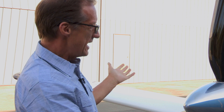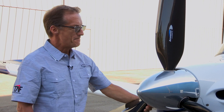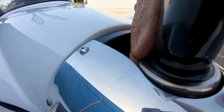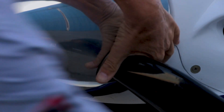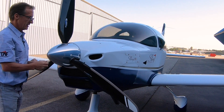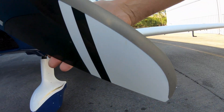Then the beautiful propeller that puts all our horsepower in and gives us traction into the sky for that 155 knots. As suggested in the Airmaster manual, I take the blades and feel for any play — I put my hand in there, feel on the bearing, and make sure there's no play backwards and forwards, no play on the blade. It's a very quick check once you know your airplane. You're checking that the thrust bearing isn't getting play, and also that after servicing nothing is loose. Then I just give the spinner a little knock in case it's getting any play. Check the condition of the blades, leading edges — all good.